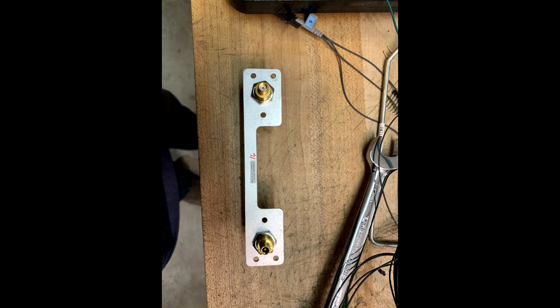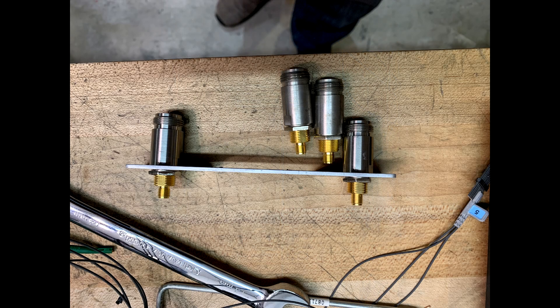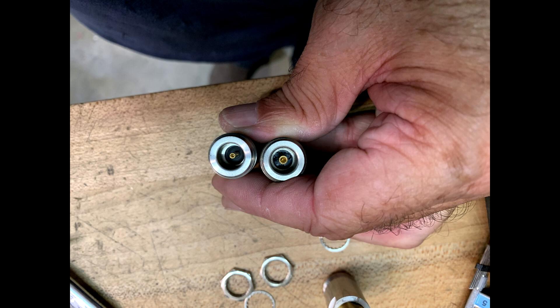I took out the RF section and pulled off the connector - this little mounting bracket that holds those two connectors - and I need to change those two out. I have two 50-ohm versions sent in by a viewer - they're the right shape and size to go in here. The 75-ohm connector is on the left and the 50-ohm is on the right. You can see the center pin is much, much smaller on the 75-ohm, and on the 50-ohm it's much larger - that's how you tell. If you try to screw a 75-ohm into a 50-ohm it won't make contact, and if you try to put a 50-ohm male into a 75-ohm female, you'll stretch the connector out and ruin it.